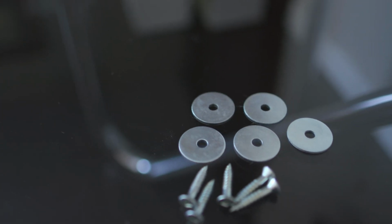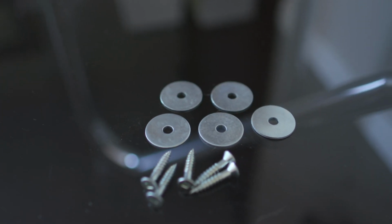In my case, I figured it would be about 10 pounds per box, so I was reasonably confident the anchors would hold. Once I worked out where the holes had to go, it wasn't that hard from there. As far as the one lining up with the studs went, it was a simple case of drilling a pilot hole and then adding a screw and a washer to secure it to the wall. I made sure the washer was pretty big to make sure that the head of the screw didn't slowly work its way through the plastic around the hole over time.